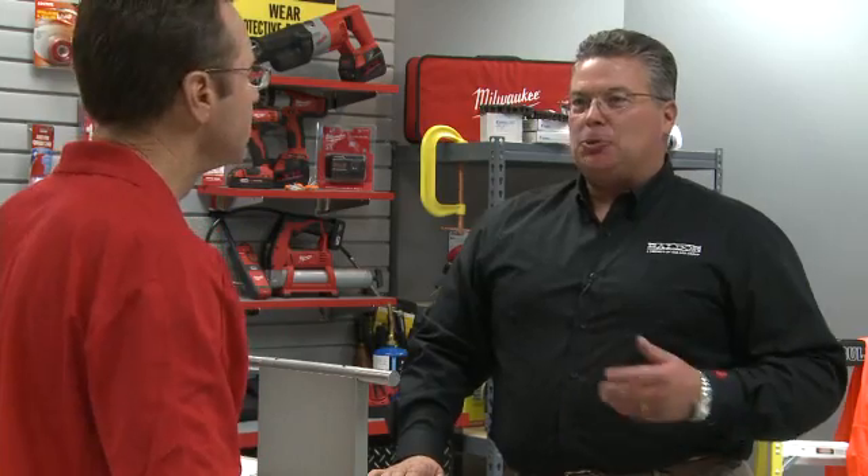Hey Dave, how are you? Hello Tom, I'm doing well. We got lots of tools here. I'm not quite sure what it is, so I'm gonna ask you — what are we gonna be doing today? Well Tom, today we're going to review the procedures for installing taper lock bushings into a sheave. This procedure is the same for installing a taper lock bushing into a sprocket, a pulley, or anything that has a taper lock hub.